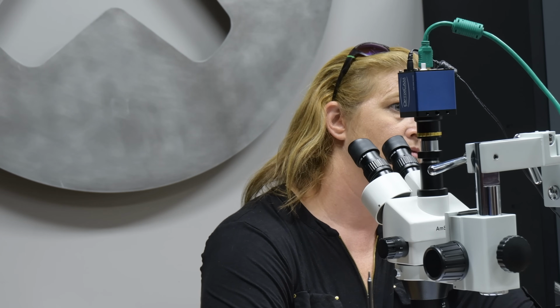So what happens to the voltage that's in that line? If you use a multimeter to ask what voltage do I have here, what would it say? Zero. It's always going to say zero, regardless of what it's supposed to be. Now, do you think that a voltage is important for a line called PP_GPU? Yes. We'll put that in the category of, if that's actually a problem, we need to solve it. So we would be very interested in whether or not that line was actually shorted or not.